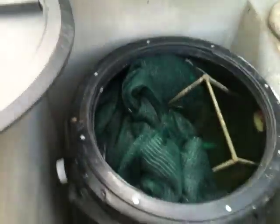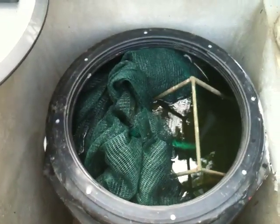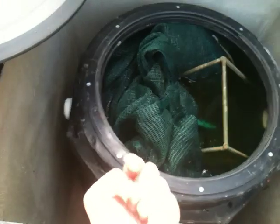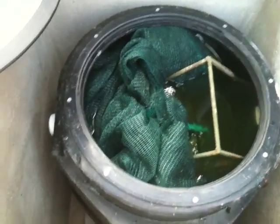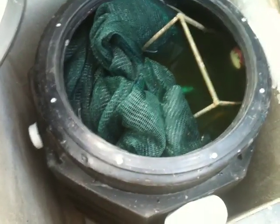But before it gets to that valve, inside of this box that you see here, the pipe splits off and goes into this system here on the left, my left. So it goes into this barrel. This is just a grease trap that I bought at a hardware store, that I reconfigured to hopefully work with my system. The pipe enters this cylinder directly from the bottom, and the barrel is filled with this saran material that is used for growing ornamental plants. I just stuffed it with that so that it would catch as many particles as possible.